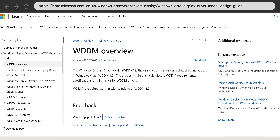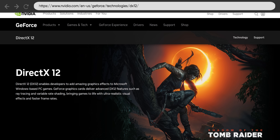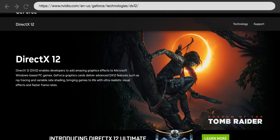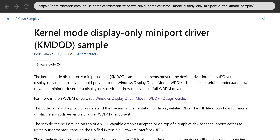Like any graphics card, Fury GPU needs some kind of driver in order to run. Barry said it took him about four months to get the drivers to work. Windows typically requires drivers to use an architecture called WDDM, and that requires support for hardware features you'd only find in mass-produced GPUs, such as support for modern versions of Direct3D. To get around this, the Fury GPU driver is designed such that Windows instead sees it as a kernel mode display only driver, which basically means Windows considers it a simpler device that just displays an image instead of doing any actual rendering.